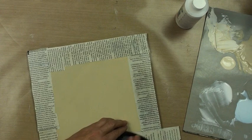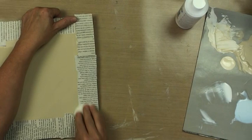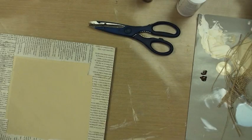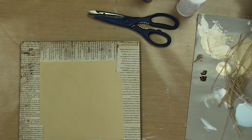I'm going to take my rough grit sandpaper and sand right on the edge of my wood. That will take the edge of the wood off so I don't have to do any trimming. Then I'll sand to roughen it up and get rid of any bumps and wiggles. I don't care if I make the print kind of faded. Now I'm going to take a little bit of umber and wash over the edges — I just don't want them to look all pretty.